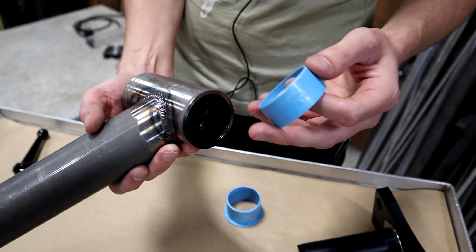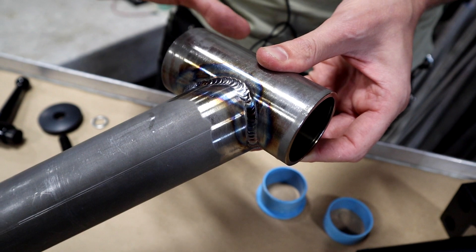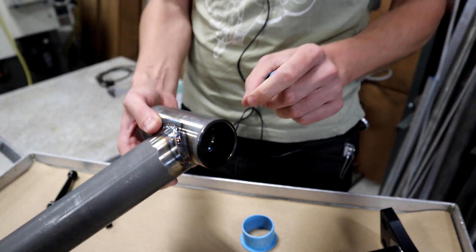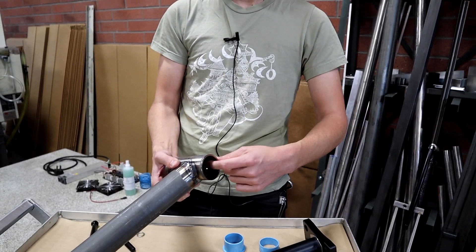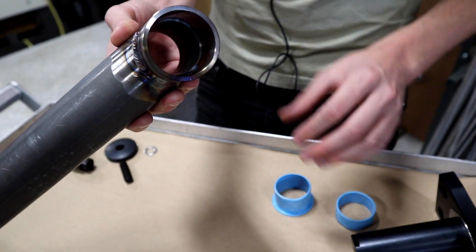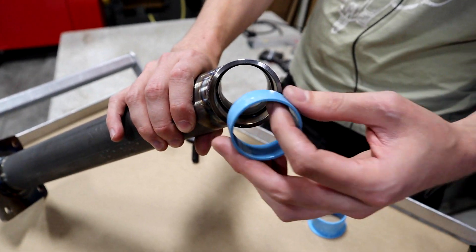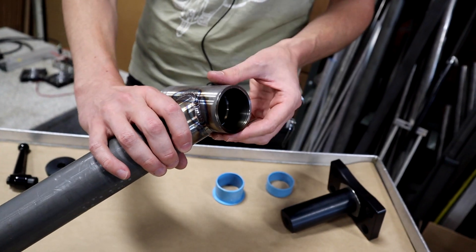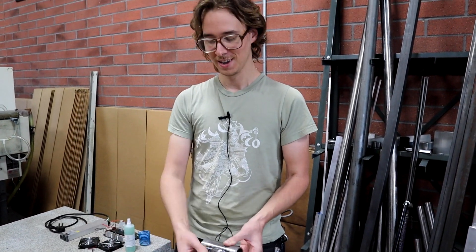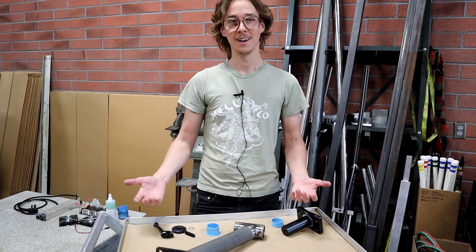In order to make this off-the-shelf component work with my use case, the weld here is going to distort the shape of the tube. I didn't really need the bearing to bear tightly against the bore through its whole depth — I only need the first little bit of it. So I relieved some material further back, so that where the weld overlaps into the press-fit zone, it's relieved a little bit. If welding puckers and distorts the shape of the tube on the inside, that distortion is not going to create an interference with the bearing. I had a lot of fun iterating on that design — running some on the lathe, testing them, seeing what the issue was, then doing another one. It's a lot of fun to develop, and I feel like I've learned a little bit about the process of CNC-machining bicycle head tubes.